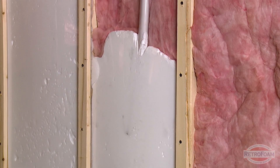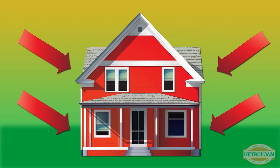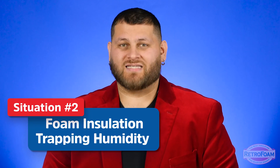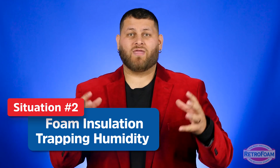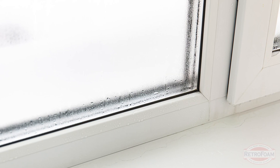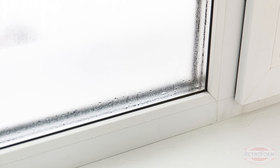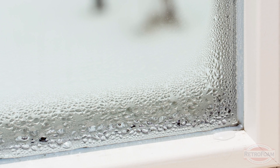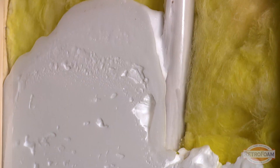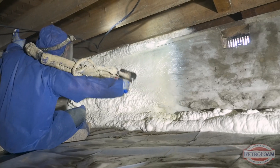The other situation when it comes to moisture is that when we're using a material like foam that helps establish your building envelope on the outer side of your house, any moisture or humidity inside your home does not escape as easily. So you can be trapping a lot of humidity in your home. Some common signs of this are condensation on the windows, or the air can feel kind of thick or muggy inside the house — especially right after having foam done, especially if you had your whole home, attic, walls, and foundation insulated with foam.